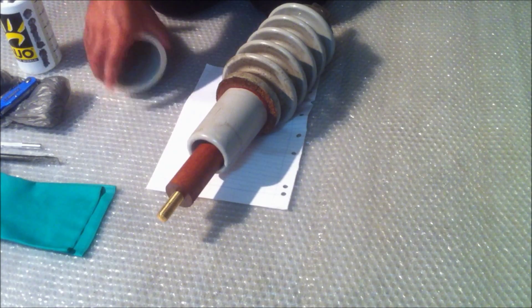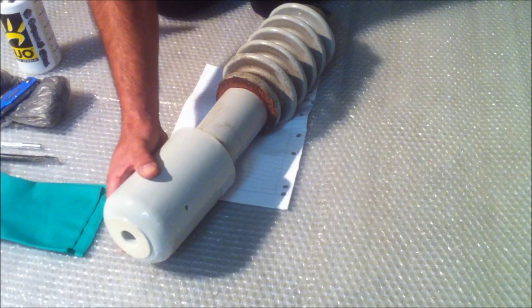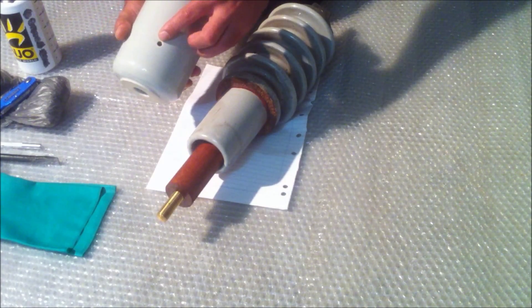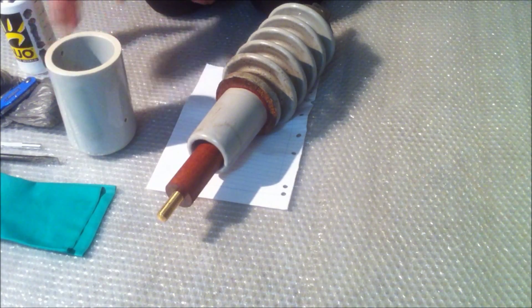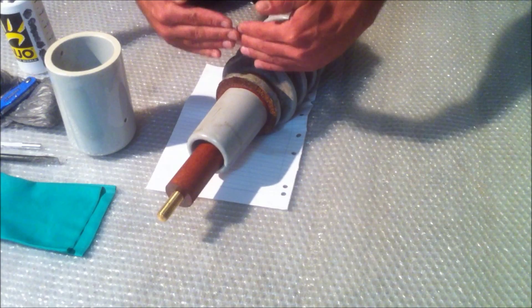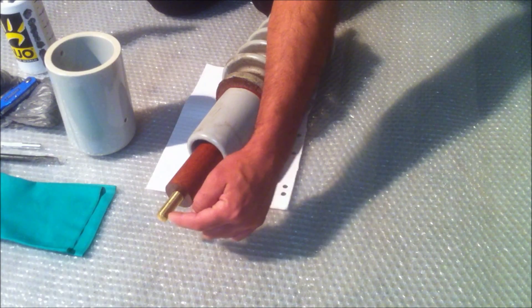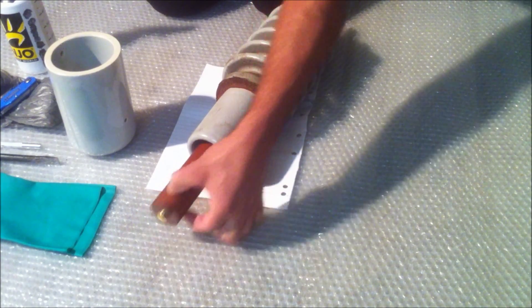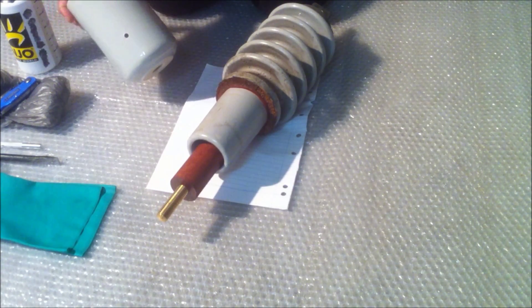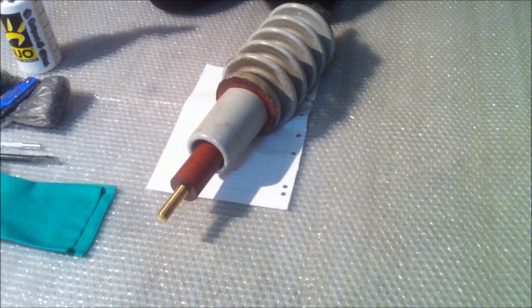This part here sits over this end on the transformer end. You can see these little holes, one at the bottom and one at the top, so that the oil can flow right inside this bushing inside the transformer. The gasket forms the seal, and this part sits outside of the transformer, and then we've got the high voltage terminal out here. We make the connection inside the transformer on this brass threaded rod. We've also got this ceramic bakelite tubing which surrounds the rod right the way through.